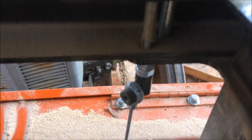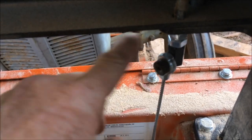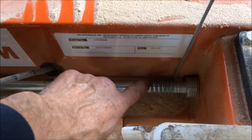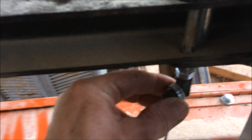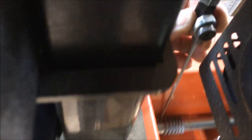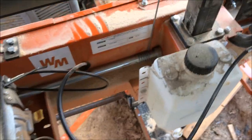If you're having a problem with them rolling up properly, you need to adjust these. This one's fairly straight back and this one's leaned off to the side a little bit. So if you're having problems with them rolling up properly, adjust which way this faces. This one rolls up from outside, so it needs to be a little closer in. And this one's more of a straight-up angle — it's rolling a little tighter, so I turned it out to pull it out a little bit more. Hopefully this helps. If you're having problems like these with your clutch or your cable adjustments, good luck and happy milling. Thanks for watching.